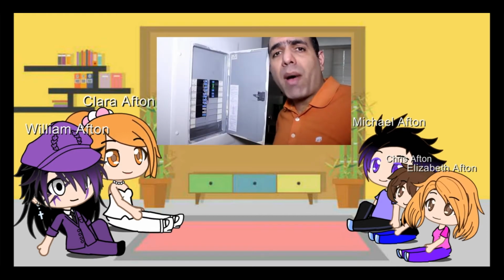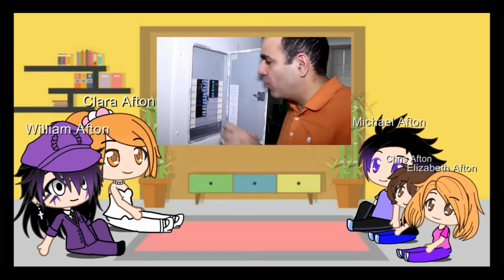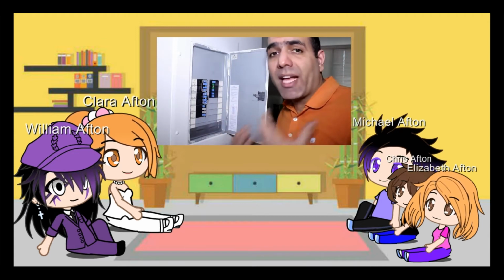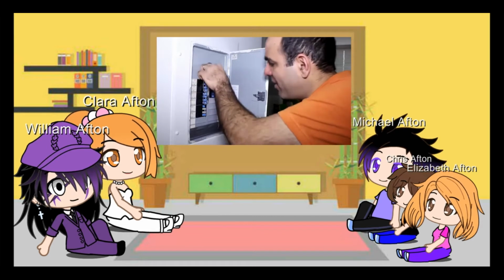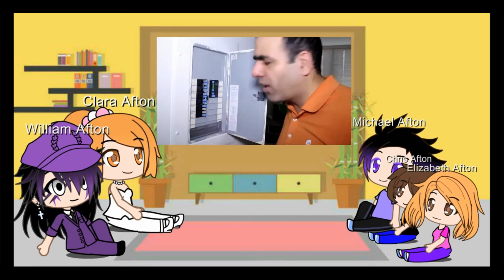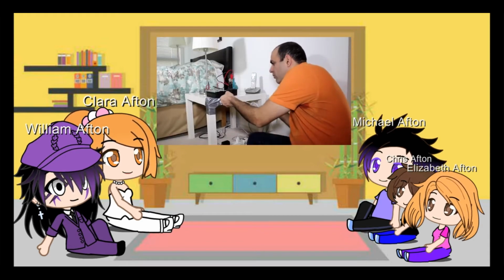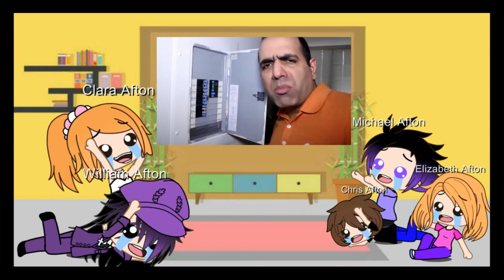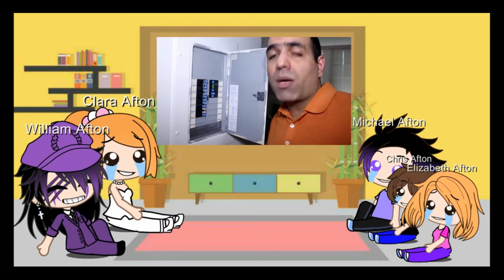So in order for me to power a room from a plug, I have to disconnect the main power and some heavy loads like the washer and the fridge because my inverter cannot take that much power. Actually, that's pretty dumb. It's better and easier if I just disconnect that specific room, which I believe is breaker number 3. Now we can safely plug them in. Apparently it was breaker number 2. Always make sure you open the correct breaker by connecting a light or something into the plug.